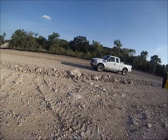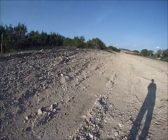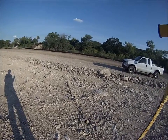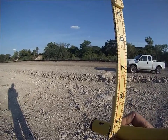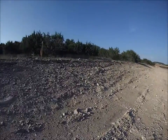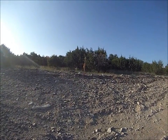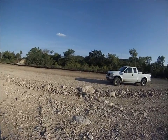To make sure it's going to drain from the toe, just go by what your plan says. This called for about a 2 or 3 percent grade. The way I was doing it is just making sure that this ground over here was not higher than the elevation I shot right here — so as long as it's lower than 335, this will be fine.